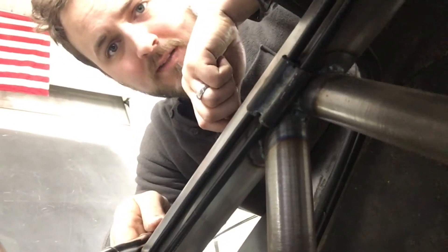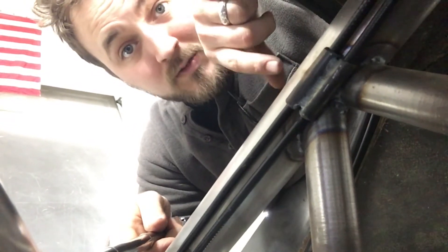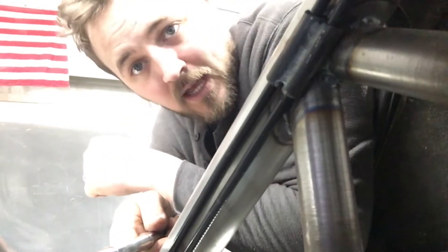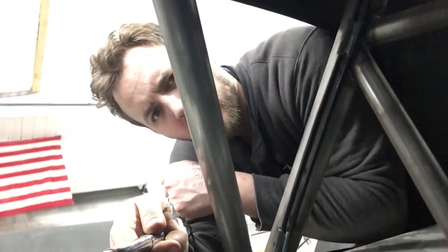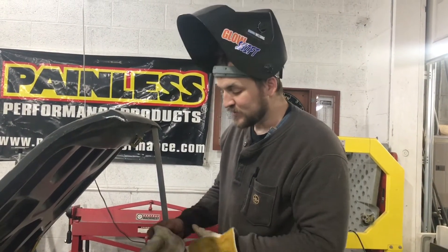We need to talk about the cables. Right here below me are the cables going to the fire bottles from the funny car cage. What we did was take some tubing and weld it onto our chassis — a good idea — so we don't have to use zip ties to run our cables through. It's very clean. We've got two of them in the cab here and one in the trunk. Now we're ready to actually hook the cables into the bottles.